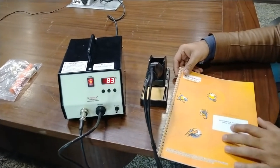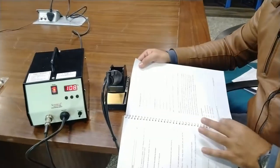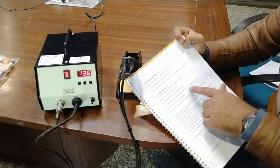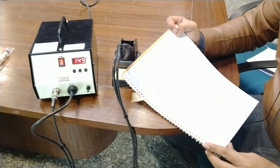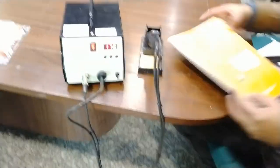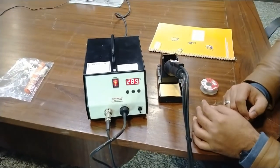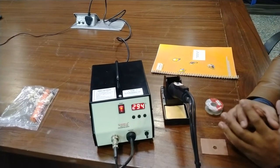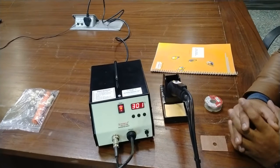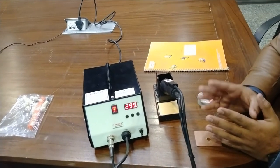Detailed descriptions are also given in the user manual provided with this kit, covering all parameter details and how to set and configure all temperature values. The desoldering station can also be locked with a password so no other person can change your required settings. The PID control automatically maintains the temperature near the set point. You can see as the temperature increases to 301 degrees, it will hold around 300 degrees, remaining within plus or minus 1 degree of the set value.